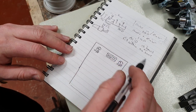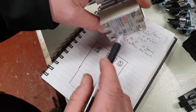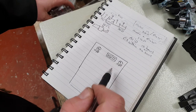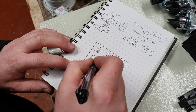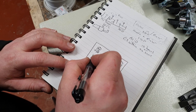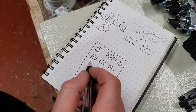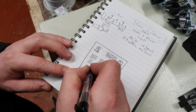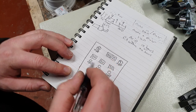The element will be protected with a float valve. The way we're going to control it with the STC-1000 is we'll run 12V control through a 40A solid state relay to switch the element. Underneath that we're going to have timers — we'll have timers for all three tanks. We'll run them for, say, 30 seconds — it'll probably be more than that but for argument's sake. Underneath these timers we're going to have independent on/off switches.